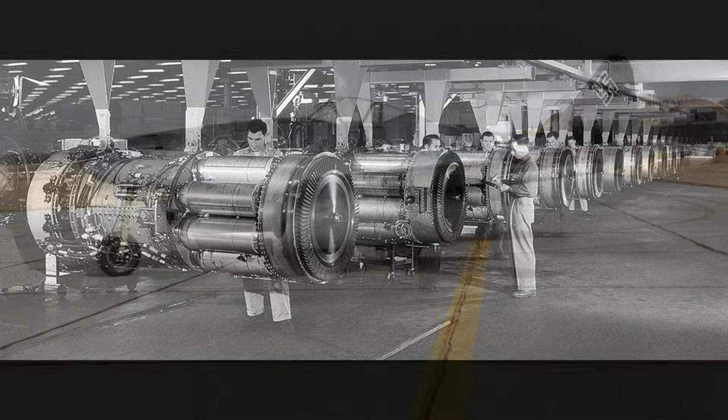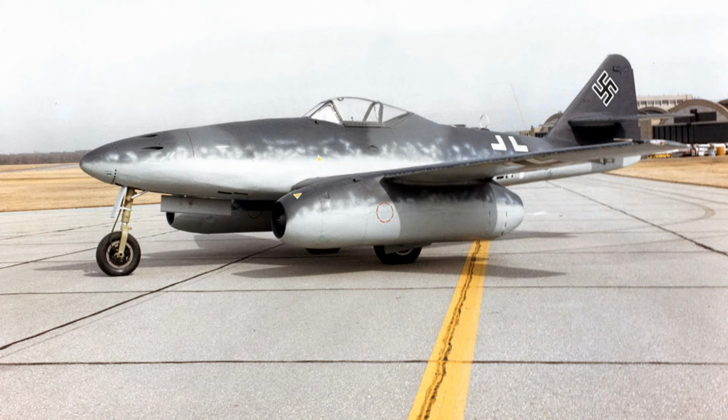It's also worth pointing out, as I did just a moment ago, that with careful technique, a skilled pilot could avoid the temperature spikes and just about double the 004's engine life. So I do think that 50 hours was reasonable, but not realistic, I guess would be a way I'd put it. Those piloting techniques, the details of all that, it's a little bit beyond the scope of this video. I might cover that another time if we talk about jet engine and turbine engine operation.